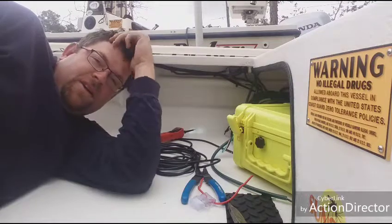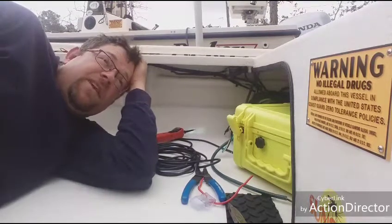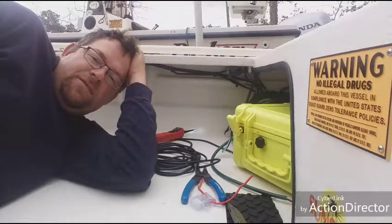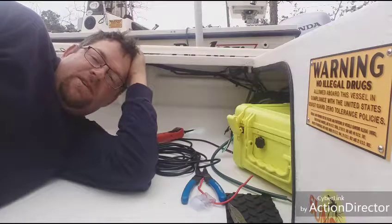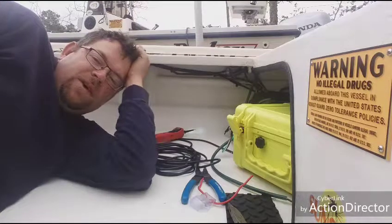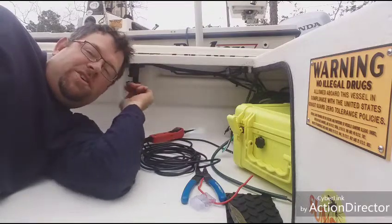What I'm doing now is I installed some LED lights — basically ground effects lights. I put some blue ones underneath inside, beneath the railings, and one underneath the polling platform, so I have three blue ones hooked in. If you ever try to install the lights yourself, just make sure that your positive goes to positive and your negative goes to negative. You can't wire them backwards and make them work like a normal DC light.